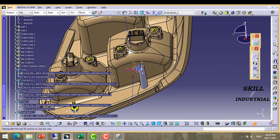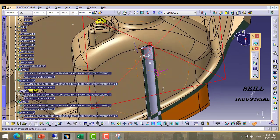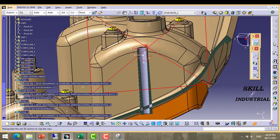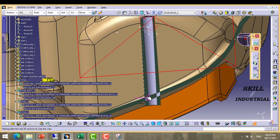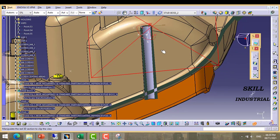If I take a section of this feature, you can see guys here wall thickness is around 2 mm, and if we go towards the downside it has suddenly increased — it becomes around 3 to 3.5 mm thick here. So this is the problem: we will get some sink mark issue in molding. So to avoid this issue, we always provide a doghouse in this type of case.